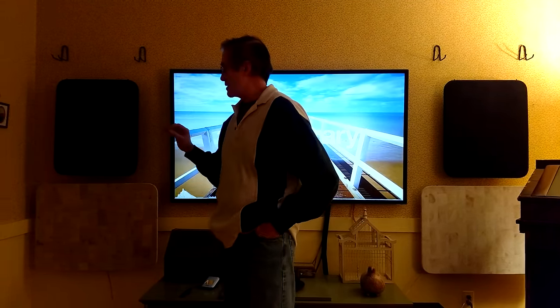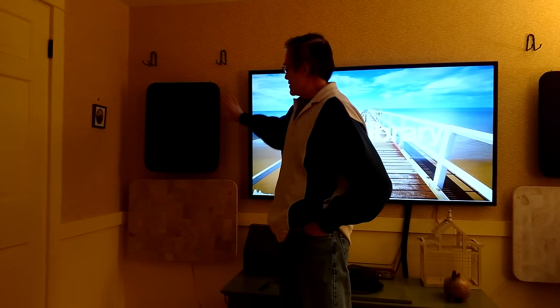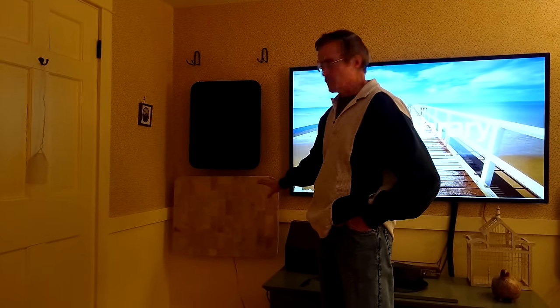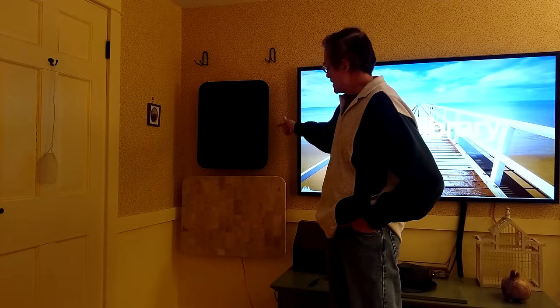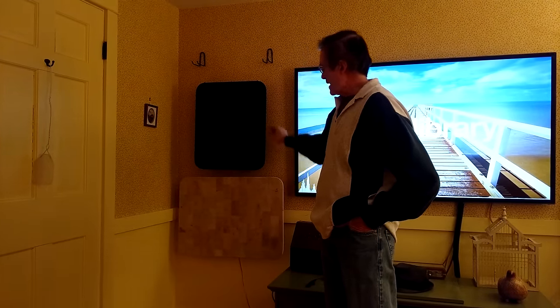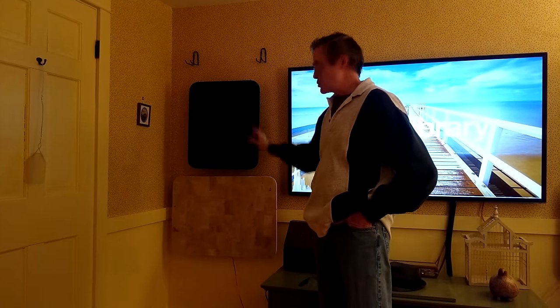To construct the speakers, I used all of the techniques I described. I built them out of two panels — the top one is polystyrene and the bottom is balsa, to get the higher and lower frequencies. Each panel has an actuator or exciter mounted on the back, and because the exciters are four ohm, they're wired in series to produce an eight ohm speaker, which is what most stereos or receivers want.